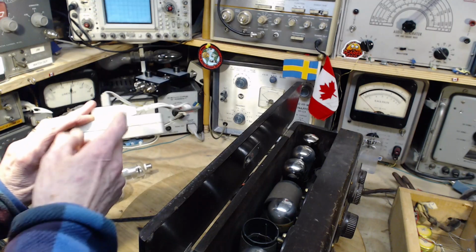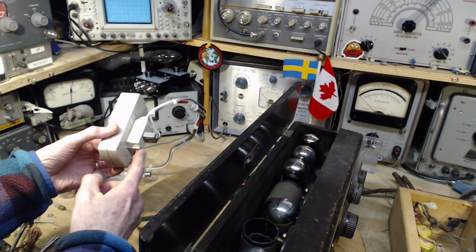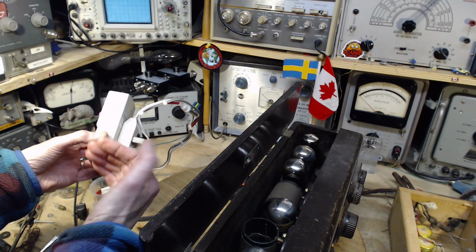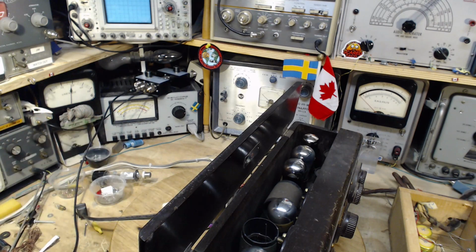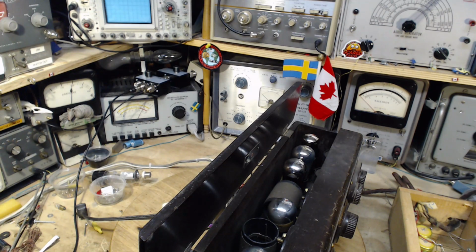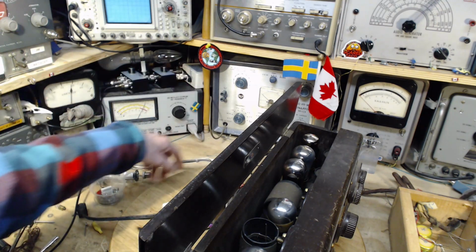The output of this box comes to here. This is just one of those devices you can buy to tell you what kind of power you're using. Very useful here. Notice the ground pin is not connected, and this is a 2-wire extension cord. There's no ground being brought over. So this is actually an isolation transformer, and for some reason I cannot explain, I have another isolation transformer that this is plugged into. So it's super isolated from the power system ground. This stuff up on top here has to do with a radio antenna, nothing to do with the power.